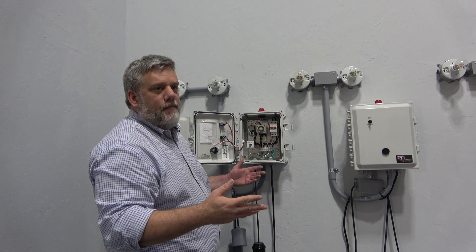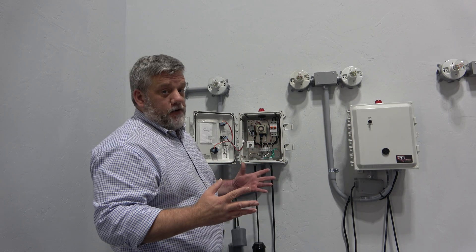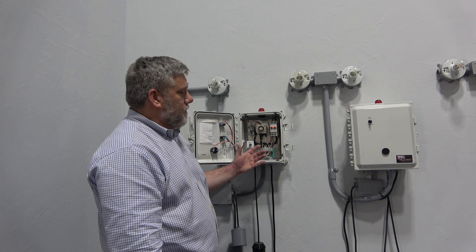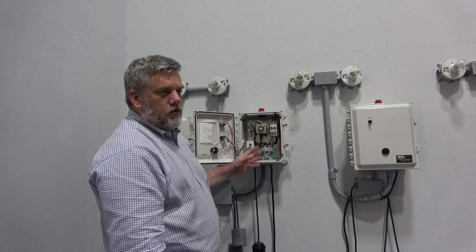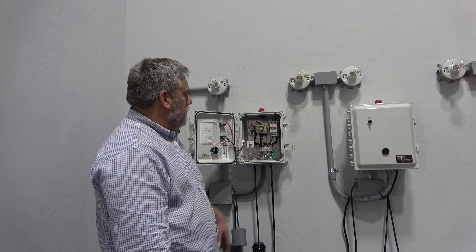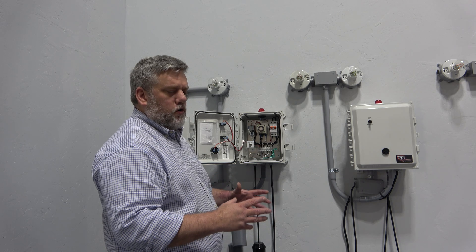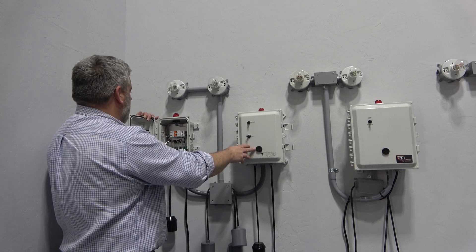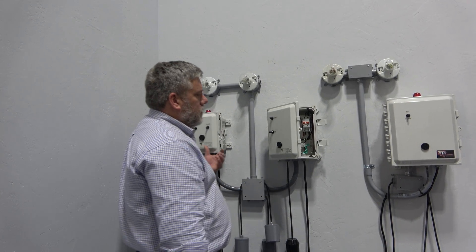You'd want even less — like 12 seconds — to accomplish that for that type of pump, since every pump is different. This timer function is different from a clock timer on an aerobic panel; those keep track of the day, while this is set for exact minutes, seconds, half hours — lots of combinations. That's a simplex dosing panel, pretty common and not that expensive. The other simplex panel we covered in a different video is just on-demand: the float comes up, the pump runs until the float goes down with nothing stopping it.